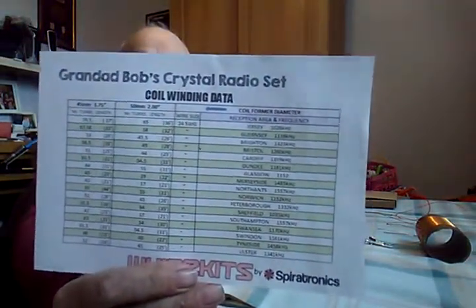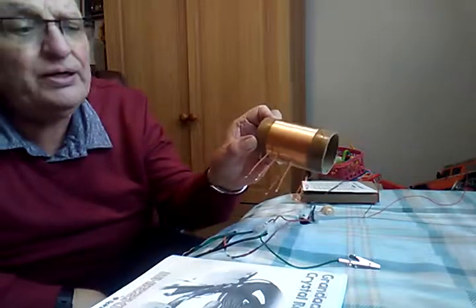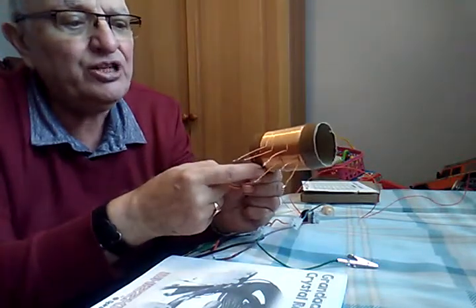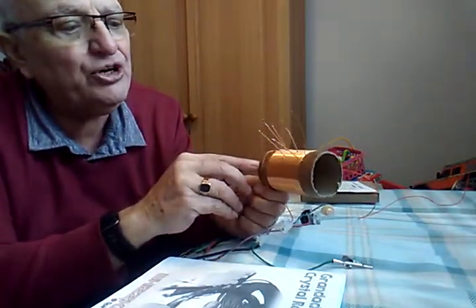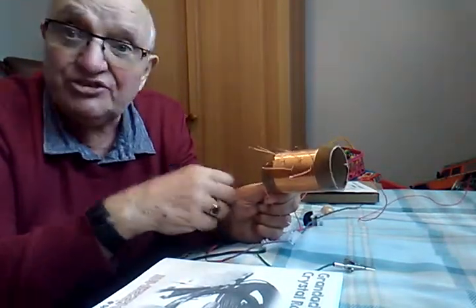You get plenty of information on where you can get the radio stations that you can hopefully pick up by winding the coil. You have to wind the coil, so I bought a two-inch tube — you don't get the tube with it unfortunately, you get all the other bits but not the tube. I bought this tube from a stationer's. This coil is wound on the two-inch tube and what it's got is what they call taps. You start winding and you put taps at every so far along — I put those taps at 15 turns, 30, 45, 65, and 75 turns, which is more or less what the booklet tells you to do.